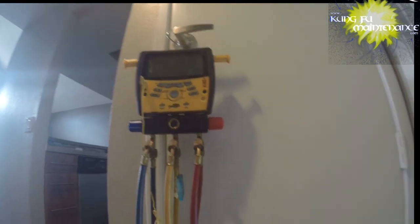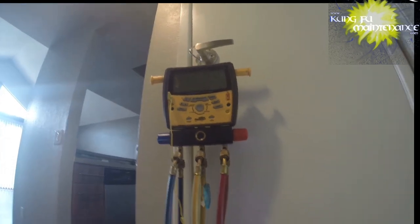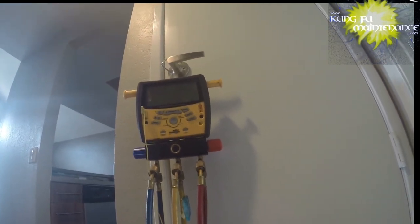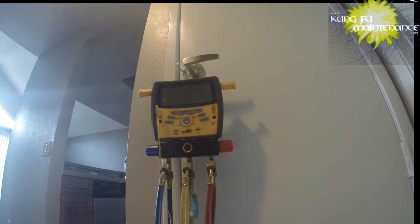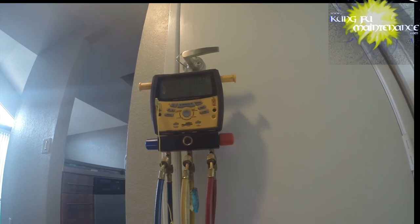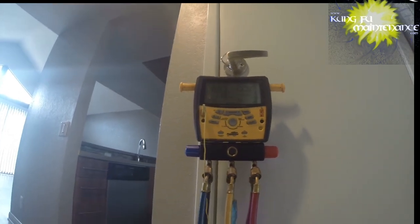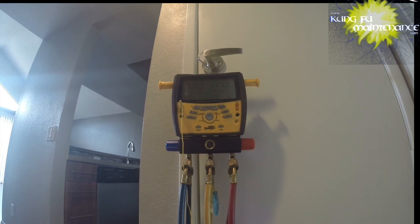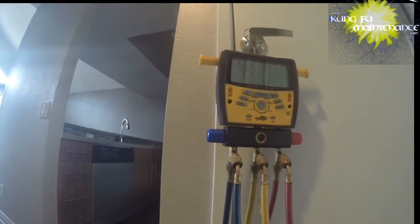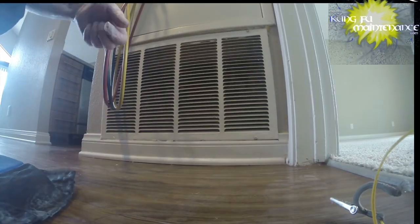And then we'll hook up the outdoor dry bulb. The outdoor dry bulb we'll take somewhere in the shade, up on the roof preferably. Since this unit's on the roof, somewhere near where the unit is, but in the shade. It looks like we're coming around now where we're bouncing back the other way. So that's about right there. So I'll hit enter. Okay, now I can disconnect that one. And now we need our outdoor dry bulb. So this goes back in the bag. Go outside and get the outdoor bulb.